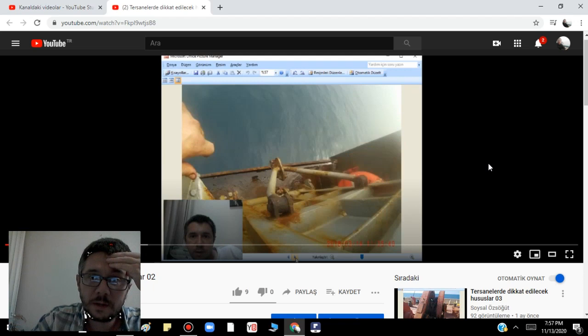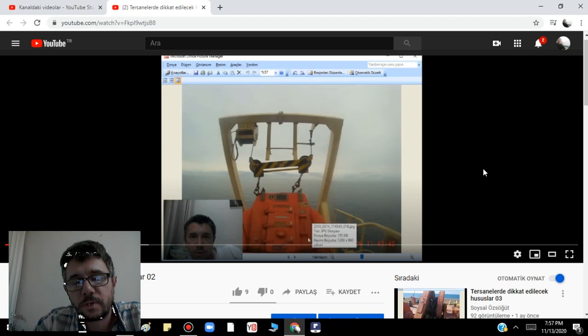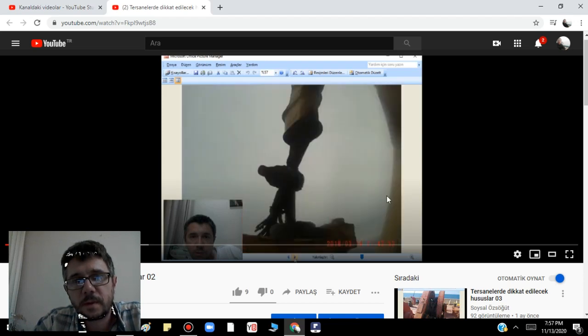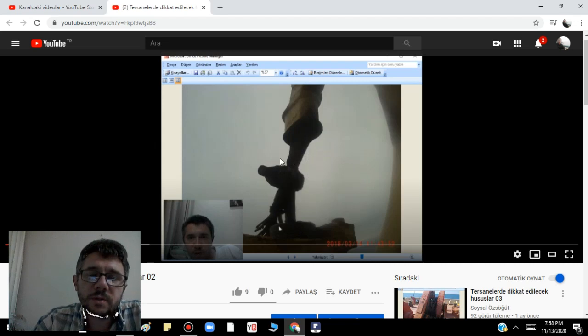You see this Manila rope is also wasted — some cracks. This is the pilot access point. What is important with the pilot access point? You see these are collapsible railings. This support point of the railings sometimes wastes, and the railing itself sometimes wastes. This is collapsible — when you go to navigation you have to take them out and put in store, when pilot comes just put back. But sometimes they always keep the railing here, and from inside the supporting point the railing becomes very rusty.